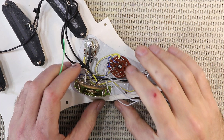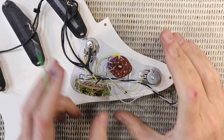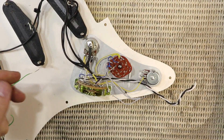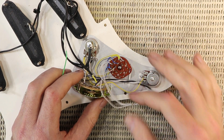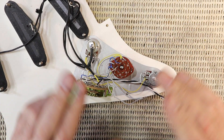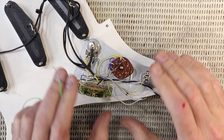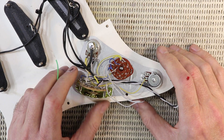Wiring something like this with lots of switch terminals and skinny little wires is not exactly everyone's idea of a good time, so I'll give you a couple of tips. Even though I'm not following the colors on this diagram exactly, I'm still using different colored wire. All of these gray wires are earth, all of this yellow wire is the same node — the hot side of the circuit — and so on. It's amazing the number of guitar circuits I've seen where everything's wired in the same color wire, and you really can't troubleshoot when it looks like that, so do yourself a favor and get some different colored wires.